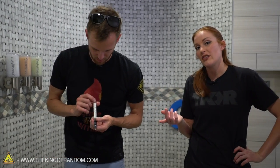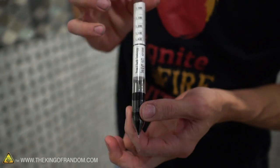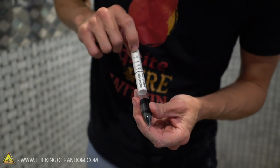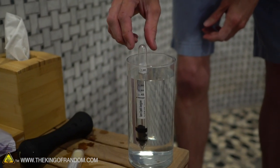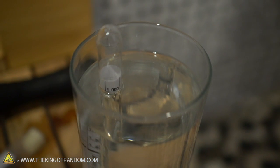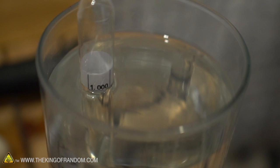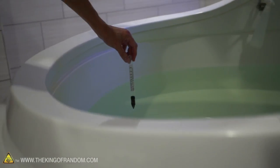So this is a buoyancy tester — it kind of gives you an idea of just how dense the water is. The idea is that this weight down here and this sealed tube are all carefully calibrated. I believe with regular water, this should sink down to the 1.000 line. We hit it — we heard it hit the bottom, but it's not touching. We're within half a millimeter; that really is right on the line. So we're seeing the density of this water is one — that's what we expect, that's what the scale is: one gram. Now we're going to see how this goes in our float pod.